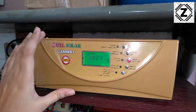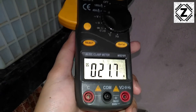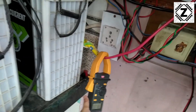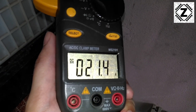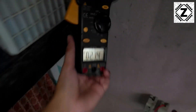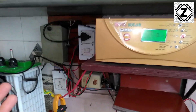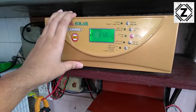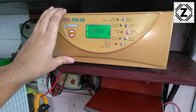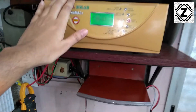All AC loads which were running through this system have been turned off. The best thing is that the charging amperes went up — any energy that was going towards running AC loads is now fully diverted to the battery bank, meaning charging efficiency has increased. Charging amperes went up from around 17-18 to somewhere around 22. So yes, we can conclude that solar PCUs can run as a dedicated charge controller, and the price difference between a dedicated solar charge controller and this solar PCU is only about 30 to 40 percent.